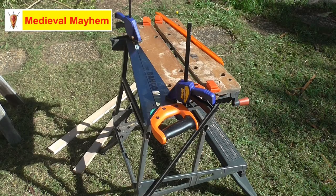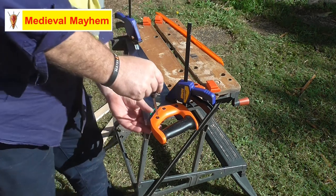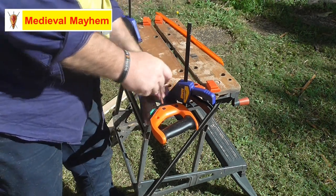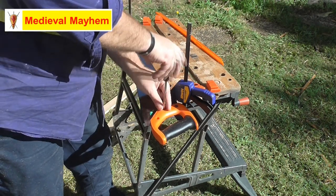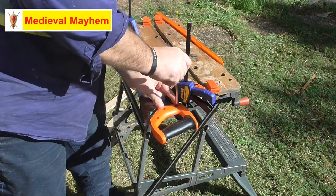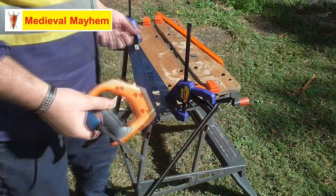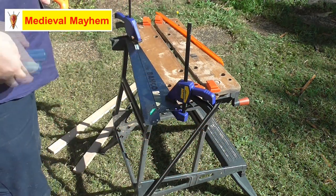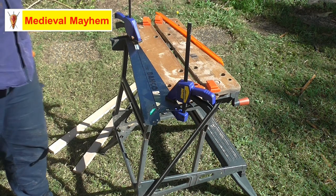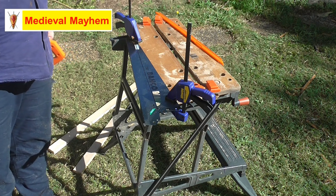In terms of a new blade for a frame saw, as I said, I can't get hold of a traditional blade anywhere, so no one seems to do replacement blades as such. So the solution to that problem that I came up with is just to make my own, and the cheapest way to do that is just to take apart a wood saw like this. This is a standard joinery blade. Fairly inexpensive, cost me less than $10, and seems to do the job.